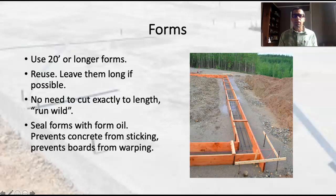I mentioned before that we're going to seal those form boards up with oil. People used to use diesel, and hopefully we've gotten away from that because it's not a good idea to be spraying diesel all over the ground and getting into the storm drains. There was a shift over to special form oil that was a little more eco-friendly, but at CR we've started using a latex water-based form oil — the technical term is a latex release. What it does is make it so that the concrete doesn't want to stick to those form boards.